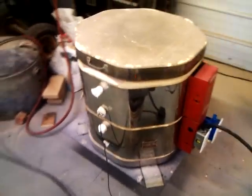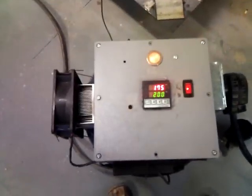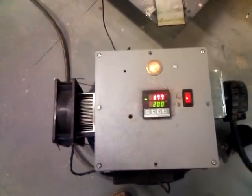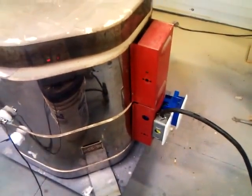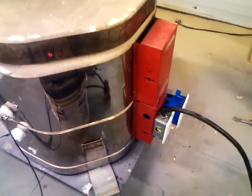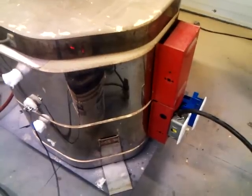What I did here is I built this digital temperature controlling unit. I did that because the control box over here all it had was low, medium, and high. That's not very good for casting glass, for big quantities of glass. It really requires some pretty specific temperatures, and you need to be able to control that within a degree or two.